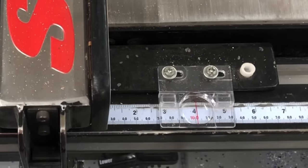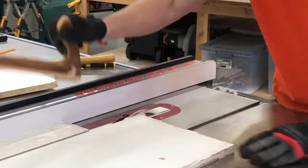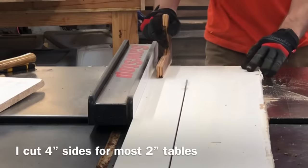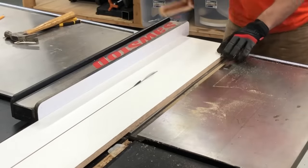For your sides, I recommend going at least one inch over the thickness of your table. So if your wood is two inches, make your sides at least three inches. I find myself cutting four-inch sides for pretty much all my tables now — it gives you a little extra breathing room and doesn't really take up a ton of extra material.